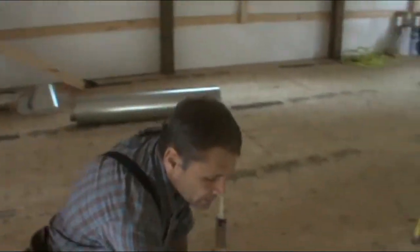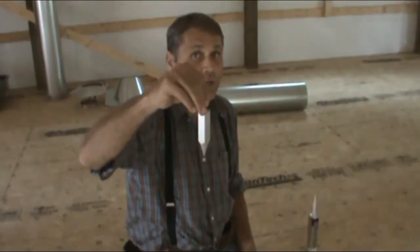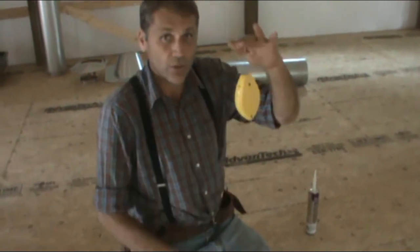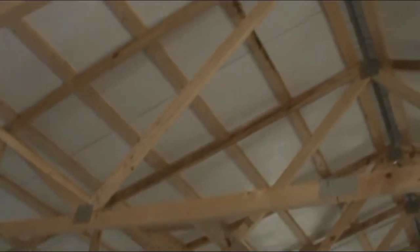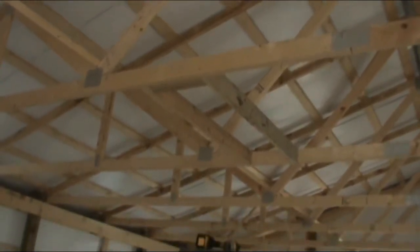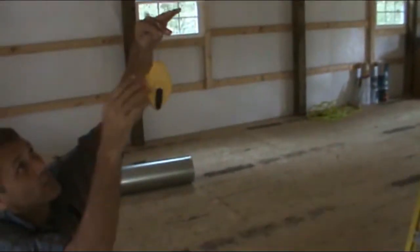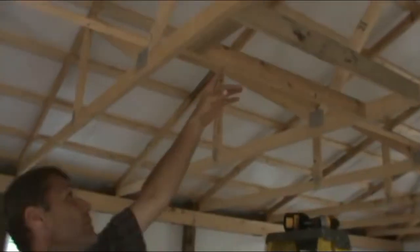To find the center part, we used, well, what's best, you should use a plumb, but we couldn't find that right away. And so we used, in case of emergency, you can use chalk line. Works the same purpose. And so we went up onto the roof on the interior. We dropped the chalk line, or the plumb, which was very nice, to the back side of where we wanted the chimney pipe running. Dropped this down and we snapped a line down on the rafter here.